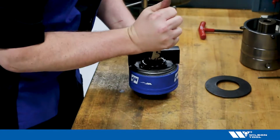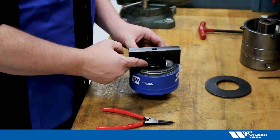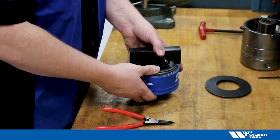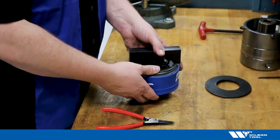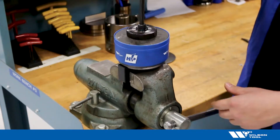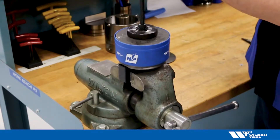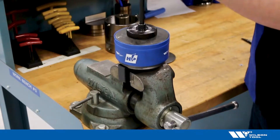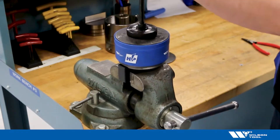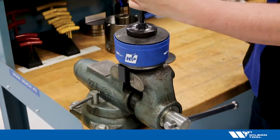Once engaged, open the retaining ring and remove. This is the result you're looking for — where the retaining ring isn't quite removed and is floating. Now we'll take our compression tool back to the vise and we will loosen the spring pack. With your 10 millimeter wrench and your tool installed securely in your vise, you're free to loosen your spring. Go slow.